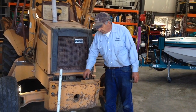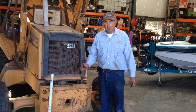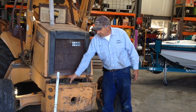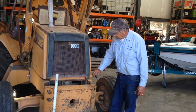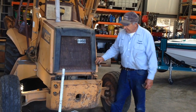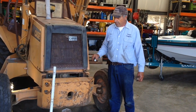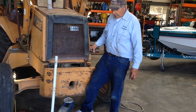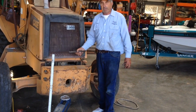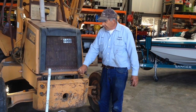First things first, these are the original bolts that hold this counterweight on. I've replaced them with a bolt just like this, so we now have four bolts extra long and I slid the counterweight out so we have access to the pump. The counterweight did tend to settle, making it difficult to pull the bolts out, so I used the floor jack to simply lift the counterweight up to get the weight off the bolts so I can slide it forward.